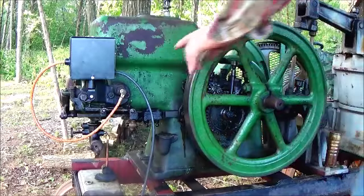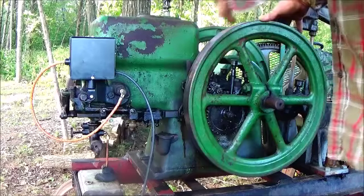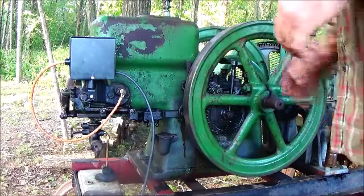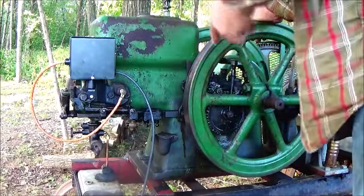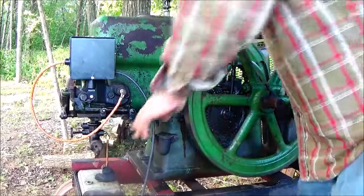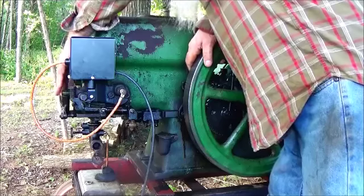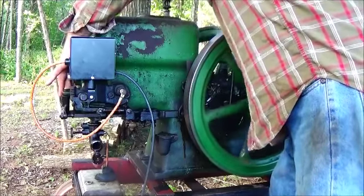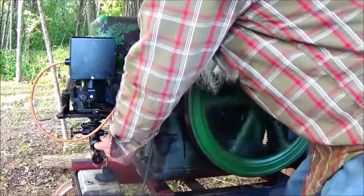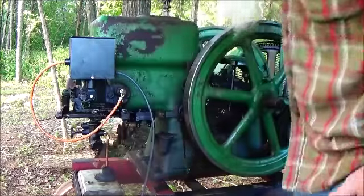I've kind of found out, and I think it's because the length of that fuel pipe is so long down in there, and the weight of that check ball in that check valve, it does take a little choke to get that initial charge of fuel up there. Easy way is to bring it around, depress the intake valve, bring your crankshaft up about halfway, stick your finger in there, and you got gas. Then you should start.